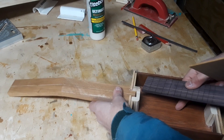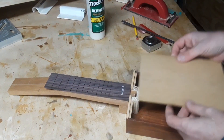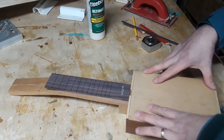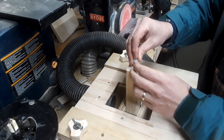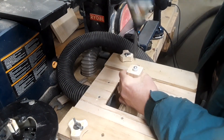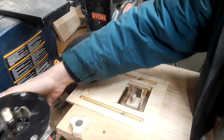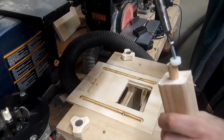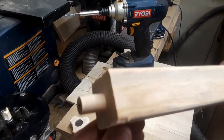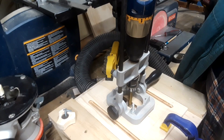The spacer comes off the bit and it's time to cut the tenon on the neck. The fit is good and my cigar box ukulele is one step closer to completion — but that's for another video. Routing on narrow and small pieces has other uses that I'm exploring. There are different router bits and other possibilities for templates, and you can trace around objects like a half-inch spacer. You can also set up for drilling — on a small test piece a drill press works better, but you wouldn't be able to do that with a longer piece.